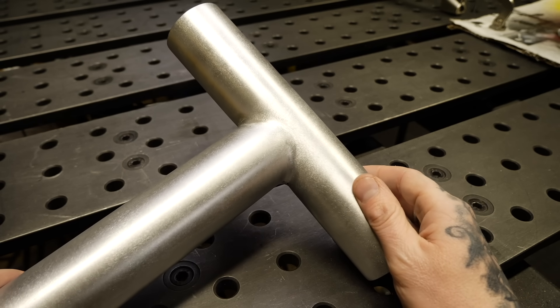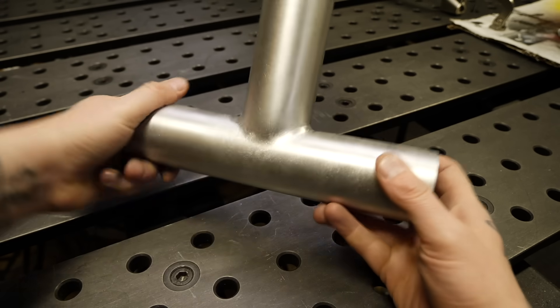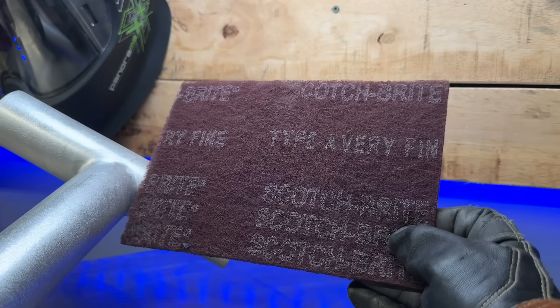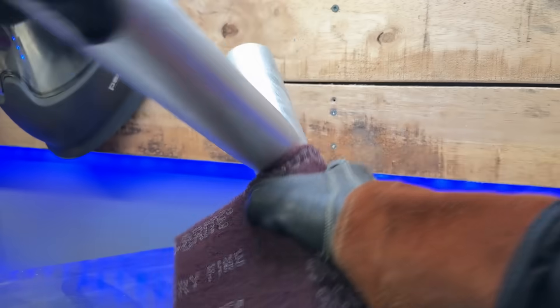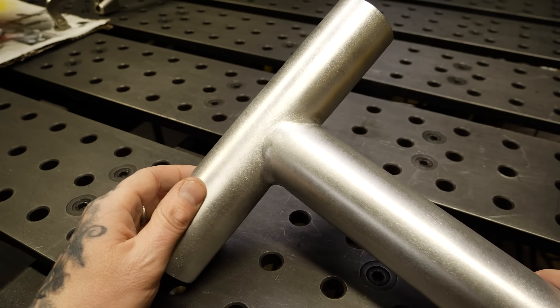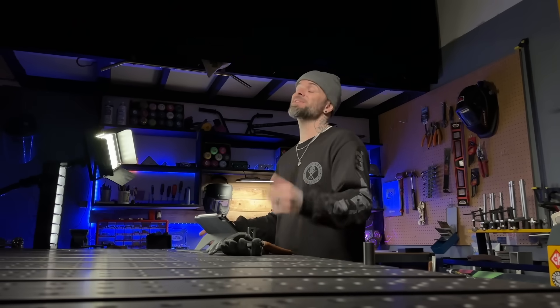When you've got everything looking pretty good with your grinding and finishing, you can decide if you want to carry on with a higher grit count on your sander. Whenever you're happy with the finish and blending, I'll grab a hand Scotchbrite pad and basically just spin the pipes in my hand. Remember how I talked at the beginning about starting with an 80 grit finish? This is where we now tie together the finishes and make everything look uniform. And honestly — look at this. It looks so good, all blended and finished together. You can even see joints left like this on bike frames and other things.